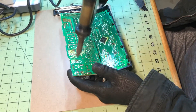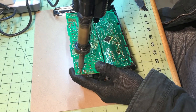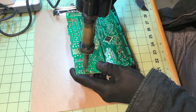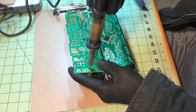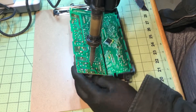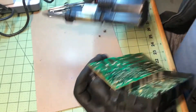One of the keys for desoldering these is you want to hold the desoldering gun for a few seconds on the pad. Don't just suck right away, because when you do that it doesn't give the solder time to melt. You also don't want to hold it on too long, or else you could heat up the pad so much that it will tear away from the board.